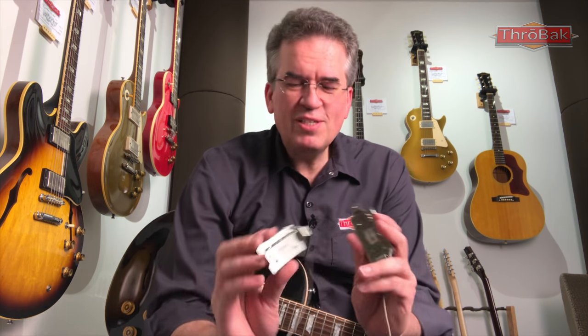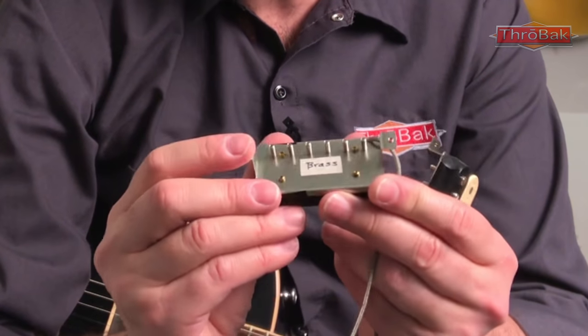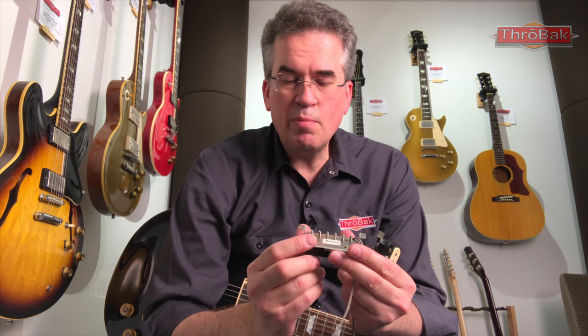What the heck are brass and steel PAF bobbin mounting screws and why should I care? Well, this is the sort of question I ask myself daily, but luckily I do care. I'll explain what the bobbin mounting screw is in a PAF. Basically the entire pickup assembly is held together by four little screws on the back of the base plate that pass through the bobbins and stabilize the whole assembly — those are the PAF bobbin mounting screws.